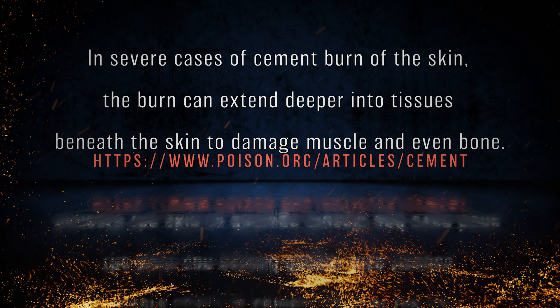Mixed concrete actually doesn't need to be put into a concrete washout pit — it can be safely poured on the ground. That'll save you a lot of time in dump fees. The mixed concrete is a lot heavier and can damage your concrete washout pit or bin. So just keep in mind that it's the washout water only that needs to be contained in the concrete washout.